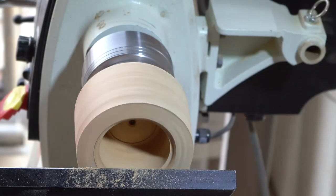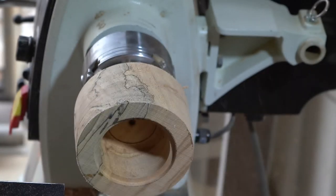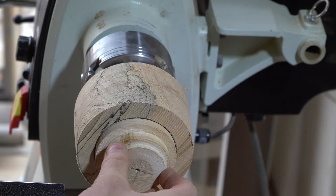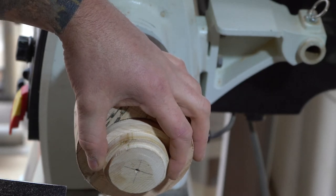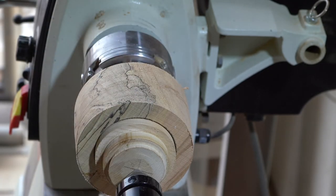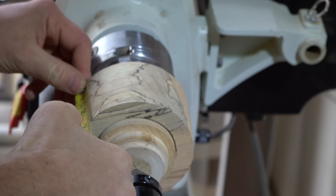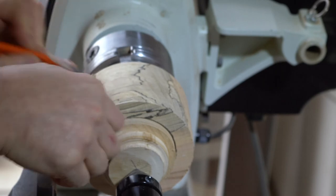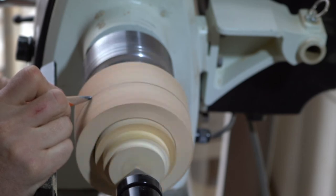Hey, there's my head. So now we've got it sitting in there. You can kind of see the little bit of a groove I put on it there. So that's where the lid's home will be. Now, I kind of had the shape in mind for this when I first started. I don't usually normally have a plan set out, but this one I kind of thought about it ahead of time. I decided on the shape I wanted. I knew I wanted to have this lid kind of recessed into it. So what I do next is I find that middle - in the middle of the bowl or pot or whatever this thing is - is going to be the high point. So I want to mark my high point, the point at which it's going to be the widest. And I'll just make a pencil line there, and I'll make sure I cut away from that going each direction.